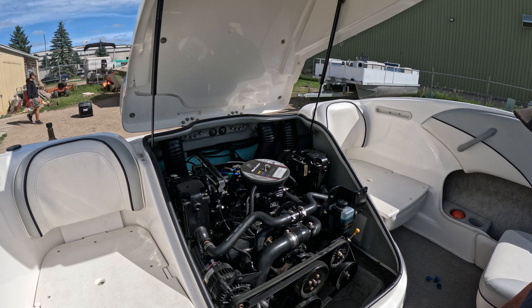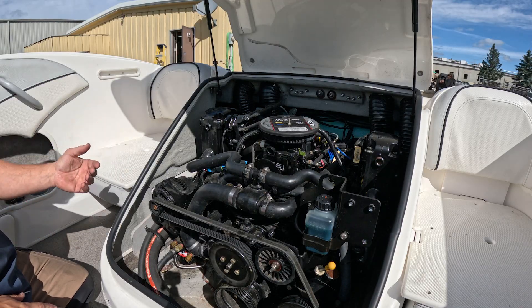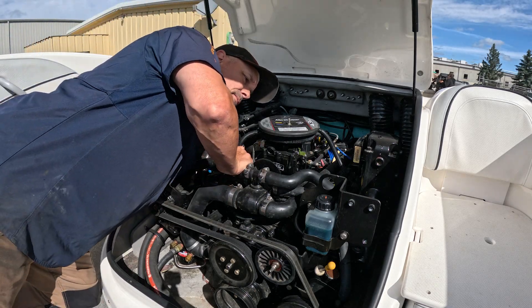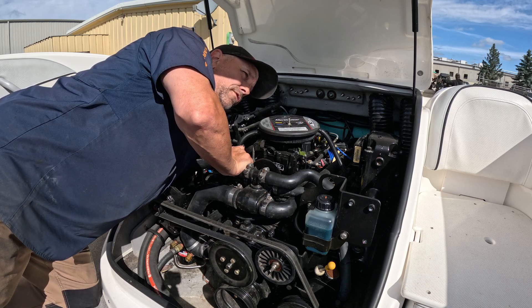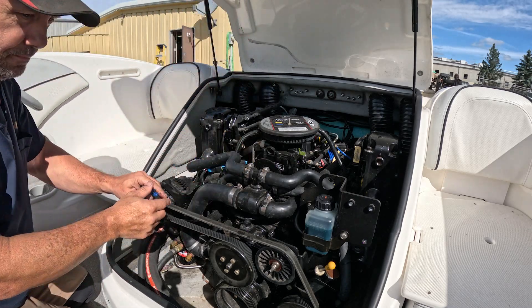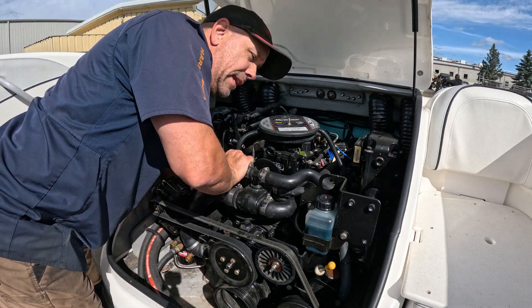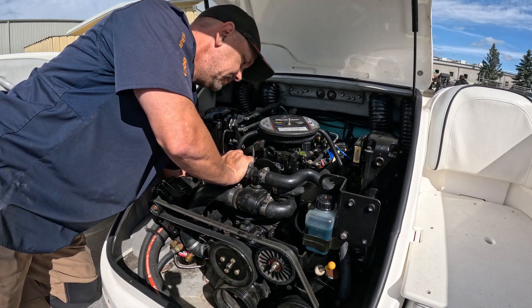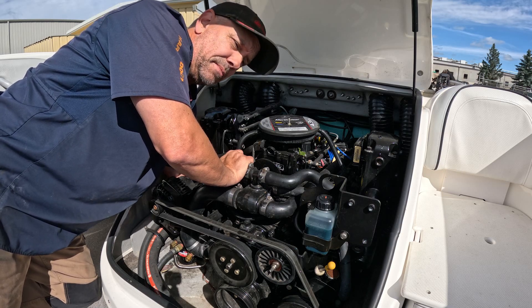If water were found, it would mean someone made a mistake and maybe didn't get all the water out. We're going to go on to the starboard side now — same thing. I'm going to reach in and grab that bottom one first by the starter, spin it out, keep my hand there, verify water flow. You can hear the water coming out, which is great — plenty of water flow there. While that's draining I'll go ahead and get the one on the manifold and again leave the hand there. It's almost as if you have to be able to see with your hands, but you can hear lots of water flow.